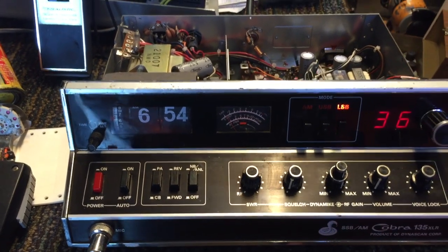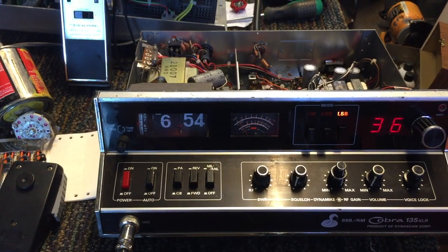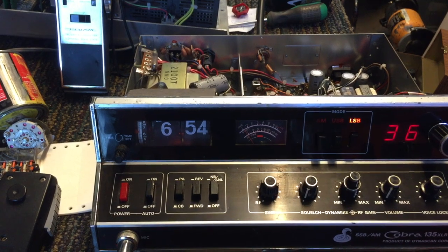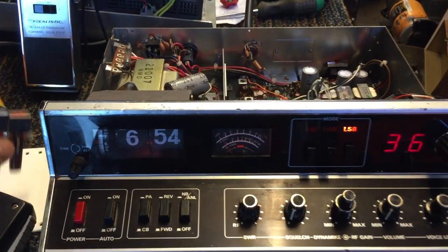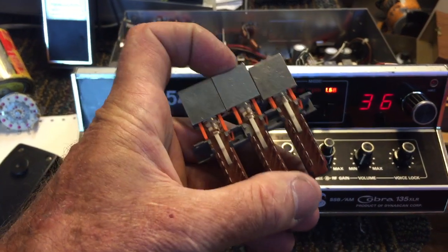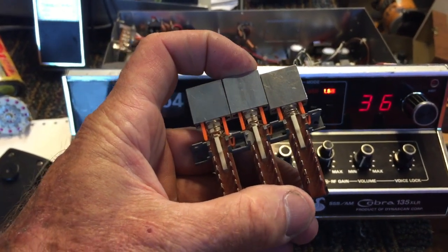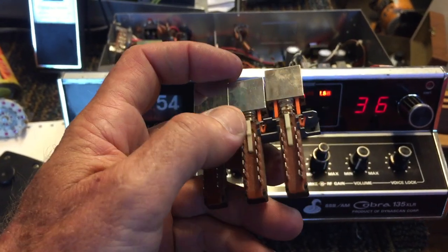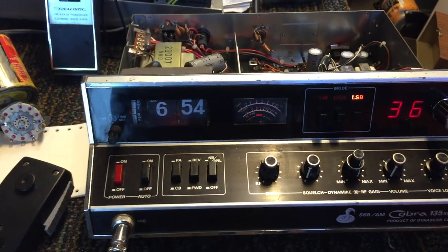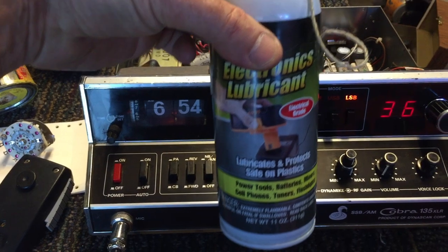I know I've talked about this before in a previous video, and I probably don't need to go over it too many times. But because I've seen this so often, I figured it wouldn't hurt to mention it again. Another area I've seen this quite a bit is in tuner amplifiers that have a mode select switch — where you switch from tape deck to phono or FM or whatever. A lot of times those get corroded inside as well, so if you've ever got a problem like that, consider the electronic lubricant cleaner.